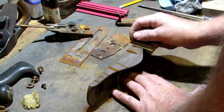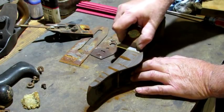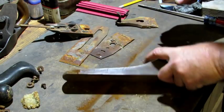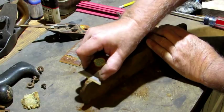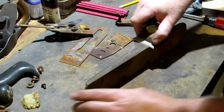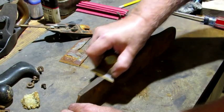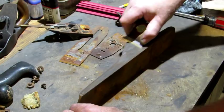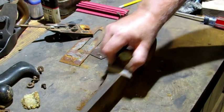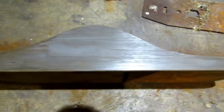Notice that I'm scraping with the direction of the machining marks. I can apply a little bit more pressure to get some of the inside right here. Turn around and get this back corner. You'll feel it smooth up — the scraper will start to slide over like ice. You can control it right and keep the patina if you don't plan on lapping it and want to keep an original aged look. And that one is scraped about as much as what you need to scrape — the before and after is already quite striking.